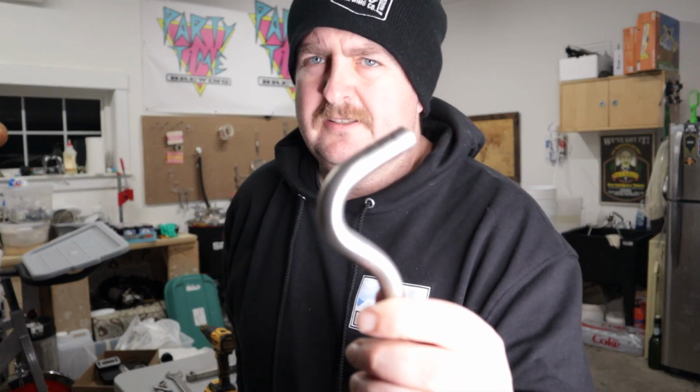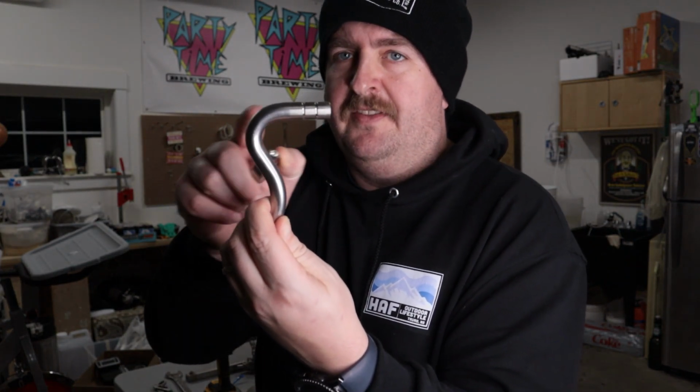The only thing that's left is the Whirlpool arm. That just basically slides in, and there's two, as you can see, 2 O-rings on the inside of the fitting, and this piece is just a piece that goes in there so you can lock this where you want it. I'm going to try it just at the 90 degrees to the flow, or basically pointing straight around. You can adjust the angle as necessary to make the smoothest whirlpool you want.